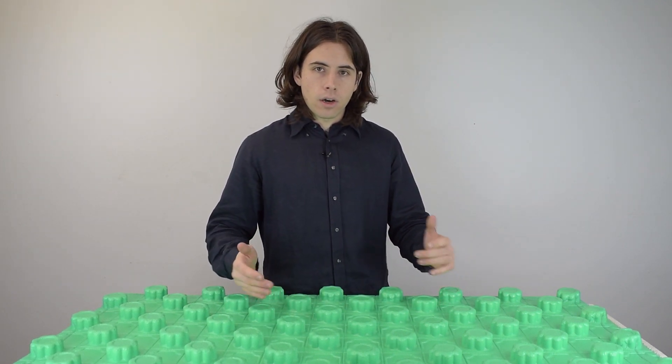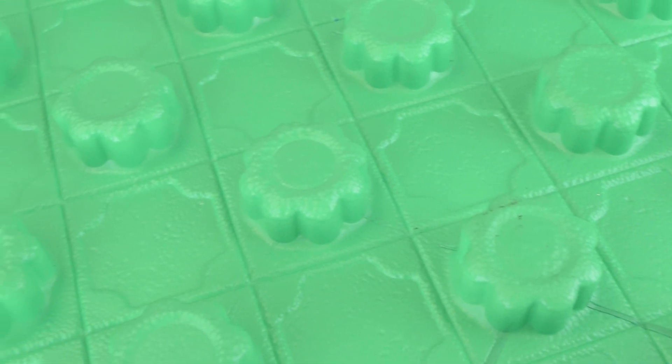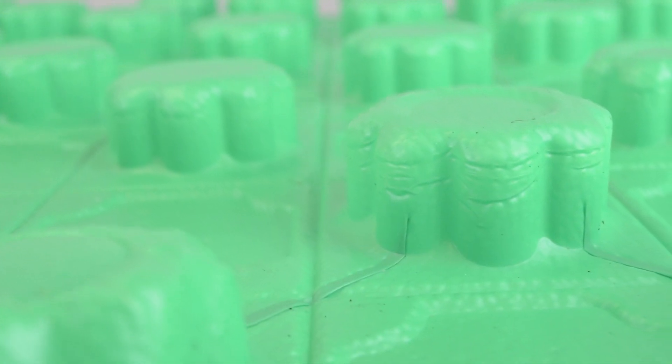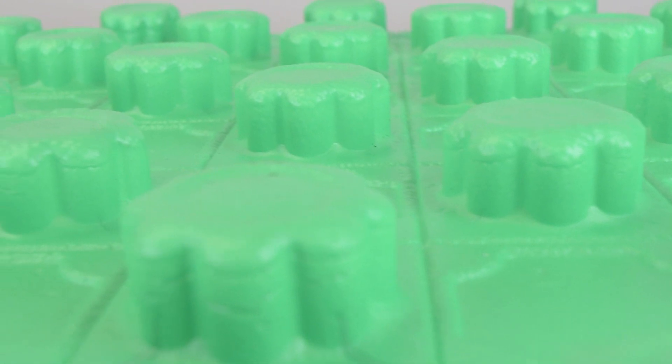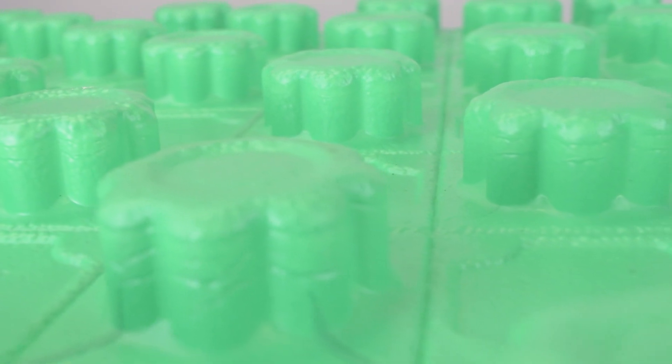For big projects, all you do is lay your PEX down like I showed you and step on it. These panels are available in one inch and two inch thickness — this here is a two inch panel. There are two different types of knob designs for holding three-eighths of an inch to one inch PEX tubing, and half inch tubing seems to work the best.